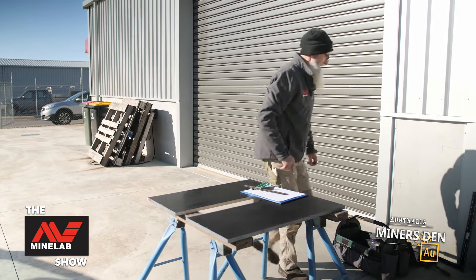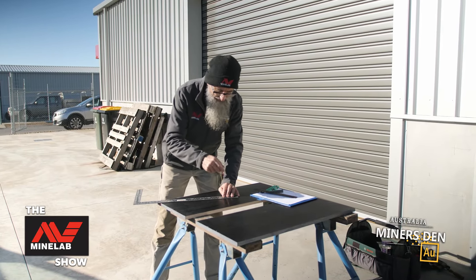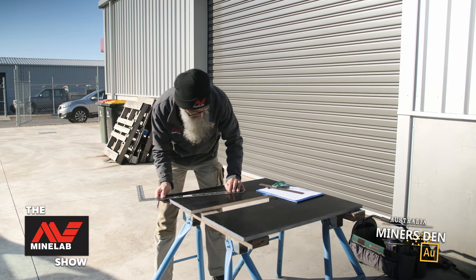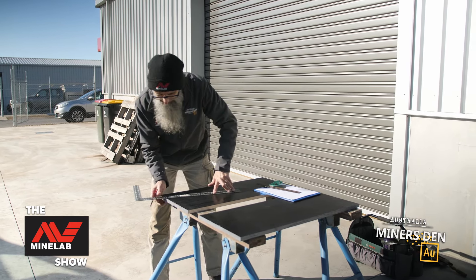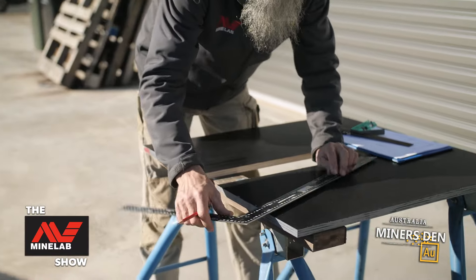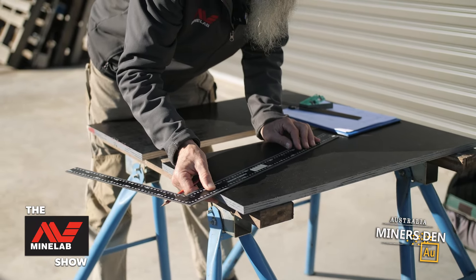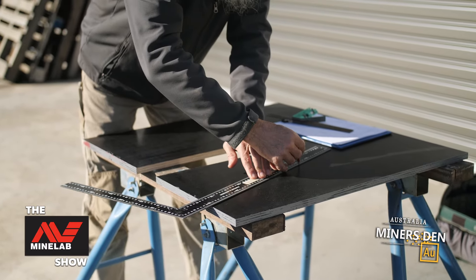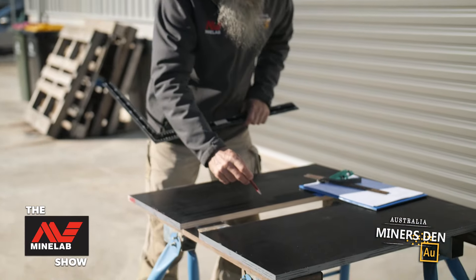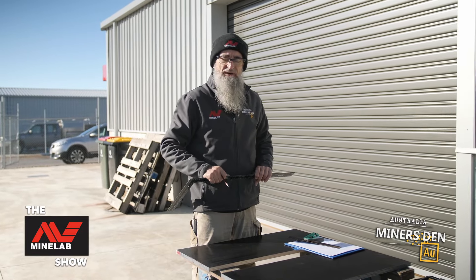Now I'll get a longer straight edge of our square, and I can just go from this marked piece here to our 90mm there - and yep, that looks pretty good. We'll do this one as well, our 90mm to 150. Happy enough with that. So this section now and this section is getting cut out, and that will then give us our shape of our rocker box.